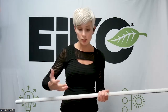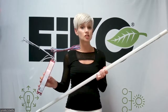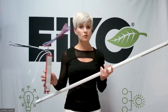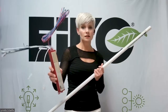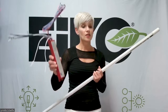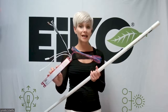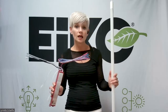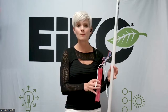This combo unit does install easily into the fixture, and it does come with that test switch. So if you ever find yourself in a competitive situation and you're asked to provide a type A tube with an integrated emergency battery backup, just recommend Ico's type B LED lamp and a five-watt emergency battery backup. This battery will provide power to one lamp for 90 minutes at five watts. You can order these as two separate part numbers — lamp and backup — or there is now a kit that comes in the same box.